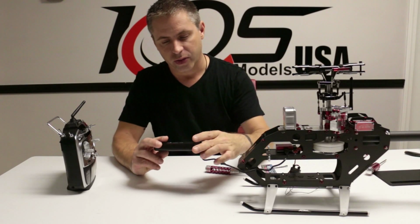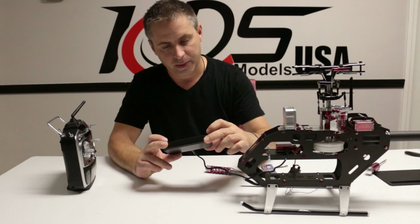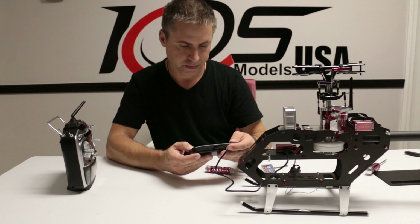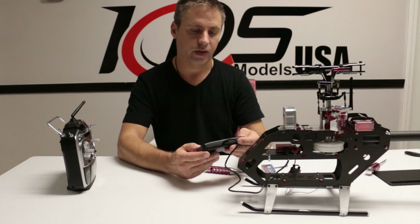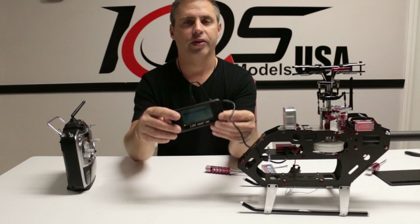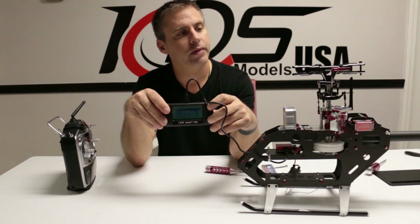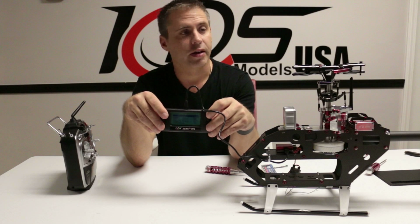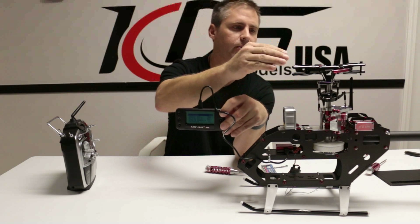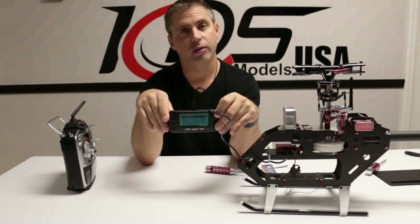When I go down to the cyclic pitch section, I'm going to go down. Yeah, cyclic travel. Okay, so we have number 2 is collective pitch. Going down 1, it's hard to work from the back of this. Takes us to the 0 setting, and down 1 more, we'll check our cyclic travel. Okay, so it's automatically moving to a certain setting. The manual recommends 8 degrees. That's a good place for everyone to start.